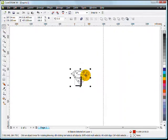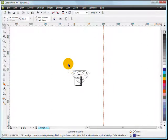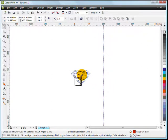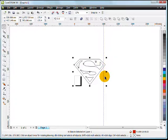Now I'm going to zoom out. Can you see on the scale up here I've made a guideline at 1000, which is 1000 millimeters, which is approximately 40 inches. And so what we want to do, positioning this from the 0 point, is supersize this till it's just over 1000. That means it's almost a meter wide. Now, the Corel software will import ratio 1:1 into SPT32, which means it'll make it 1 meter wide in SPT32 when we paste it, but we can scale it down.